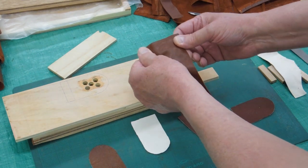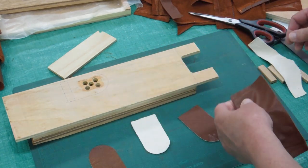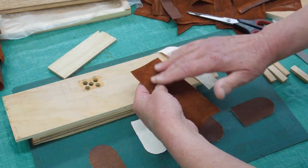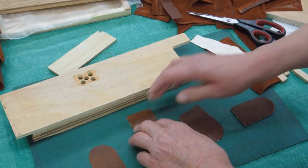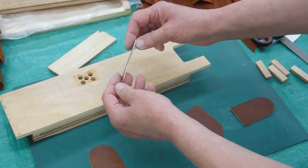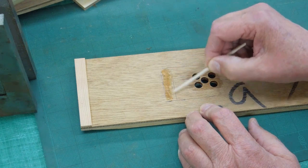I took an old jacket apart and got this leather that's about one millimeter thick. It's a little bit stiff, not quite thick enough for the valves. I found some white leather that's real soft, and then I used the felt and leather glue — put the glue on the textured side of the brown leather, attached that to the white, put that on a smooth surface, put a board on top of it with some weight until it dried. Now I have these one-and-a-half millimeter thick flappers for these valves. The fish glue is very tacky, very very sticky. It has the advantage that you can clean it up with water.